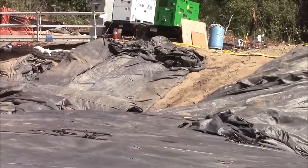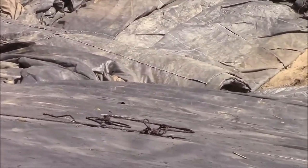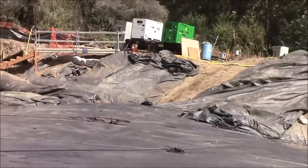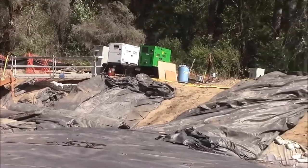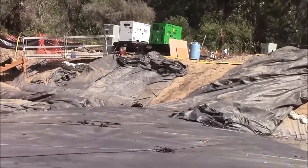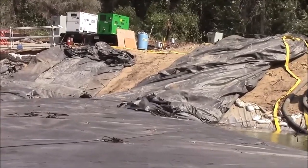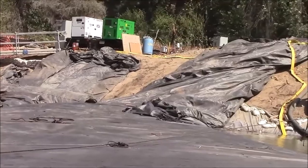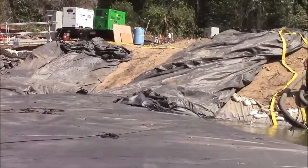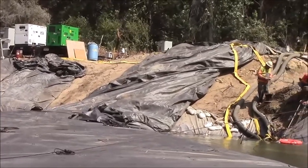Next to it are the fill tubes and a partially unrolled roll of 12-foot tall by 100-foot long aquadam. It will be installed basically where it lays, right next to the upstream side of the start of the 16-foot tall aquadam. This 12-footer is to give additional support to the upstream side of the primary cofferdam formed by the 16-foot tall aquadam.